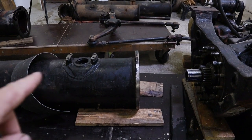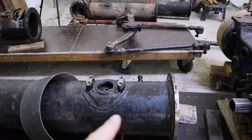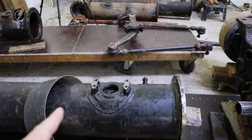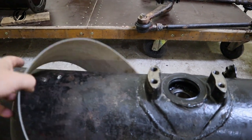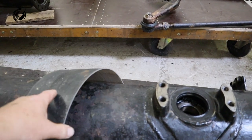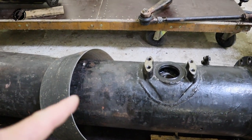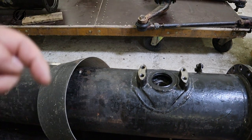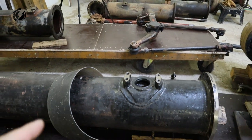First, we are going to start with the front of the tube, and we are going to make a cut somewhere over here. I will measure the distance from the end. Then I am going to wrap the tube with this vinyl tile. It's pretty convenient to use. And we will make the mark around the tube as precisely as possible and then cut it. This cut must be first.